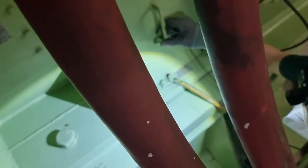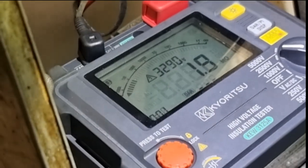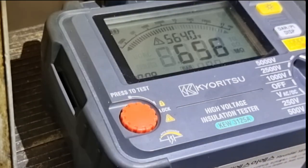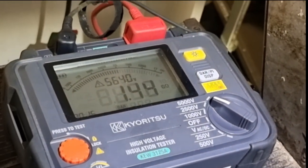After that, I did the line-to-ground test and set the insulation resistance tester to 5000 volts, which is the only tester available on board. The other probe is connected to one of the windings. Please take note: do not touch any of the lines once the test has started. We should get an infinity or giga-ohms value on the winding insulation resistance.